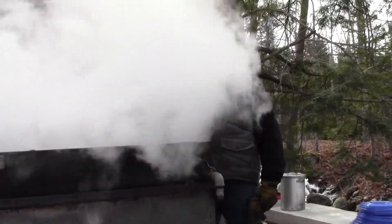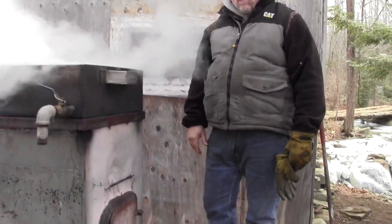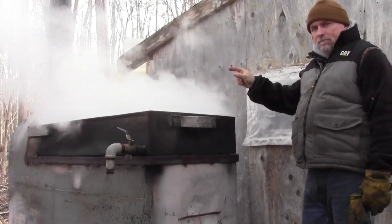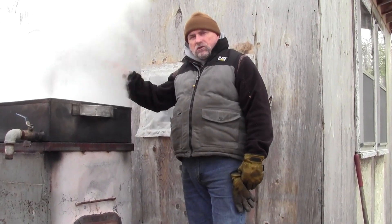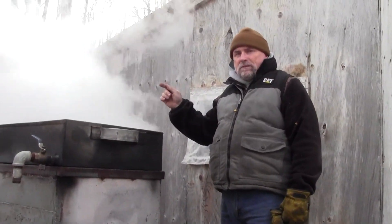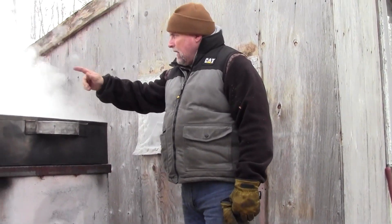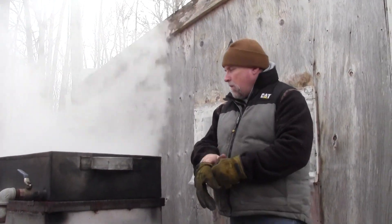As you can see — well, you can't see me — but there's lots of steam, lots of evaporation going on. I've got a good fire on, and this system for preheating is working really, really well. I did see a couple guys say they had a problem keeping their sap warm because it wasn't close enough to the pipe. The key is to get that on that pipe as tight as you can, and to do that, have your pipe standing independently so you can wrap it really tight and anchor it as you go. Then it will always stay hot like it's supposed to.